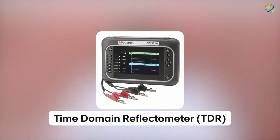Number eight: time domain reflectometer. TDR is an electronic device that network technicians use to test cables, including coaxial cables and twisted pairs. This is done by transmitting a signal through the cable and analyzing the reflected signal. The TDR points out issues such as loose connectors, crimps, conductor bends, etc. We also have an optical time domain reflectometer (OTDR), which works the same way but is used on optical fibers only. Since optical fibers use light to transmit data, OTDR transmits light through the cable instead of a signal, and potential problems are found through the reflected light.